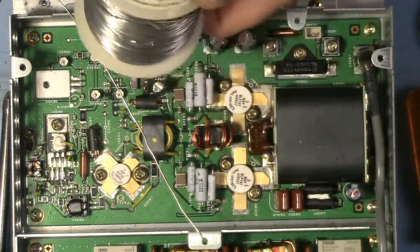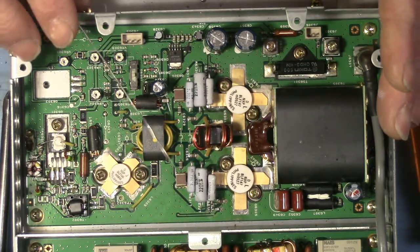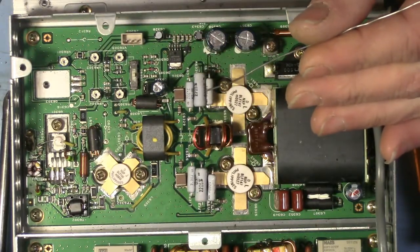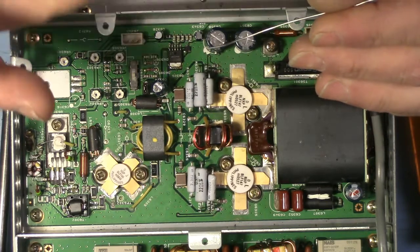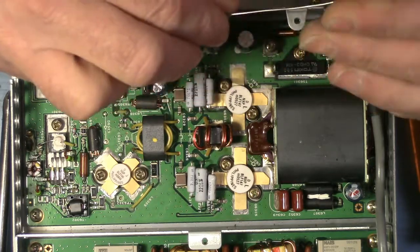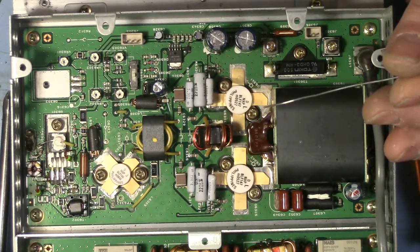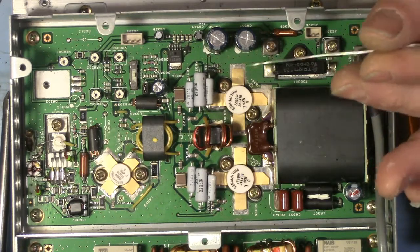And it works. It's okay. Just be aware that most of it has a slightly higher melting temperature, and it's very fluid. It does not tend to wick in between the parts or on parts as well as the lead solder. So if you're soldering things where the solder may run away, it may in fact run away.